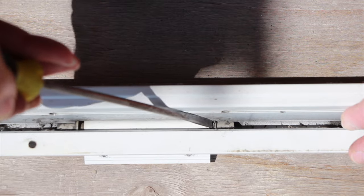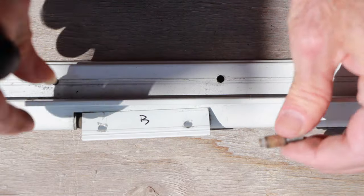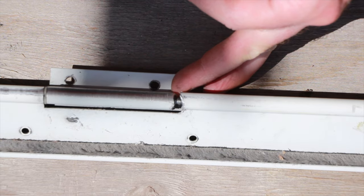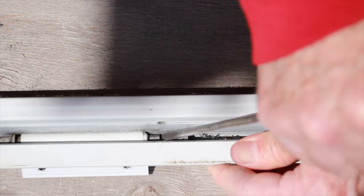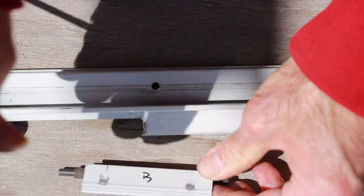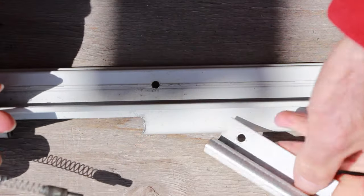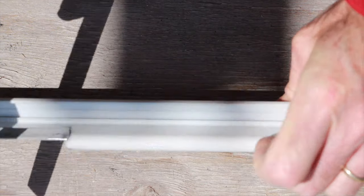So what we're going to do is just push that back, and inside loaded with a spring is a part like this. You can see the pin right there. So we just need to go in from behind, push the pin forward and pop the hinge out. There you can see this end is in bad shape — that should just slide out. So now I'll just file this damaged part so that it's flush.